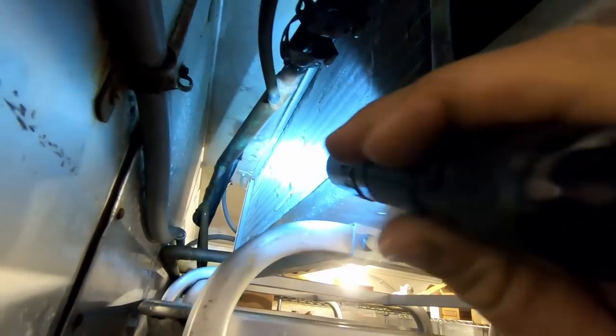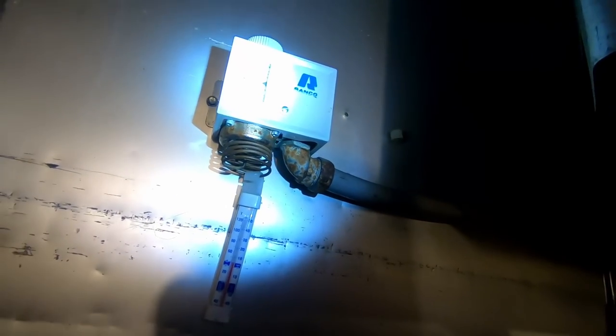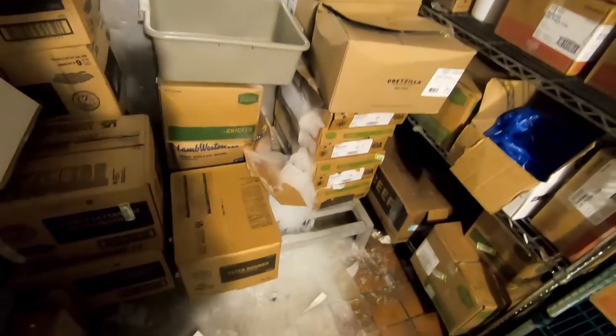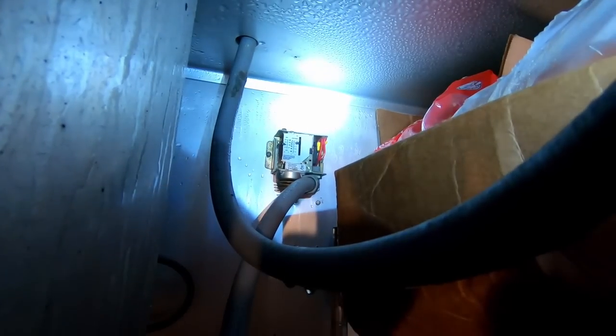It defrosts pretty quick, which I'm really surprised by. There's a place to rub out — not insulated. We've got a temperature control there running about normal temperatures. That goes down to the end and I don't see any solenoid valves — I wonder if they're running it all the way back to the contactor and just shutting it off at the contactor. Here's the freezer — it's got some obvious defrost issues. It probably started to freeze up pretty good when they brought in that warm air. They've had to wire the defroster heater elements on with wire. There's no cover on it — it's high voltage.